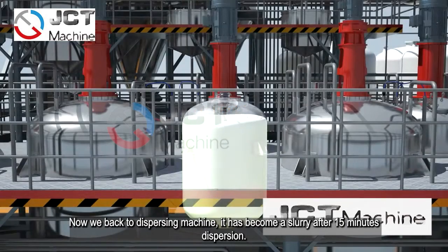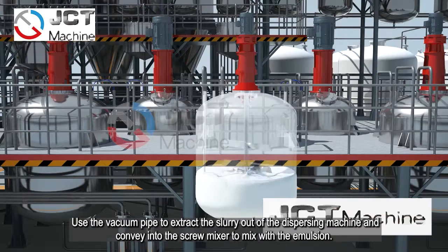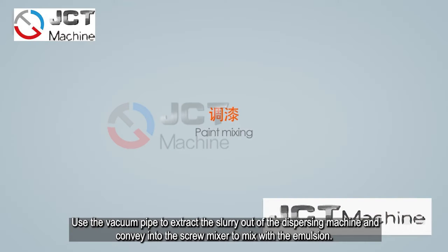Now we're back to the dispersion machine. It has become a slurry after 15 minutes of dispersion. Use the vacuum pipe to extract the slurry out of the dispersion machine and convey it into the screw mixer to mix with the emulsion.